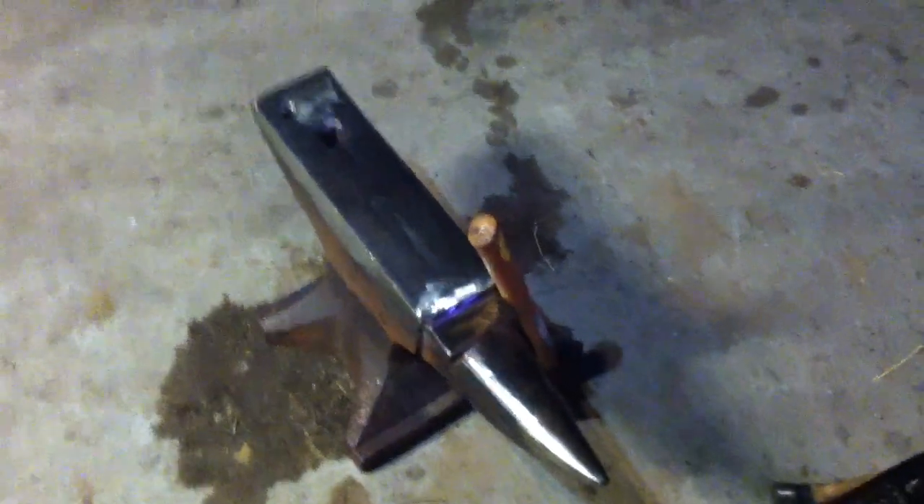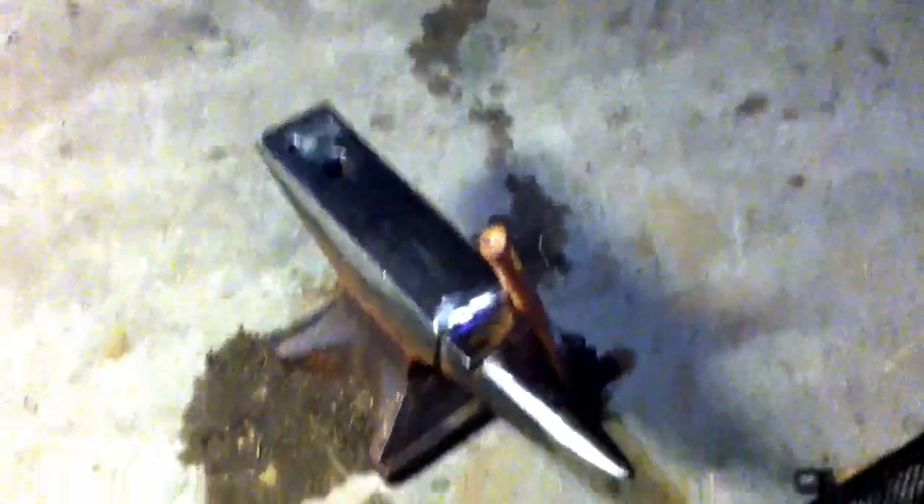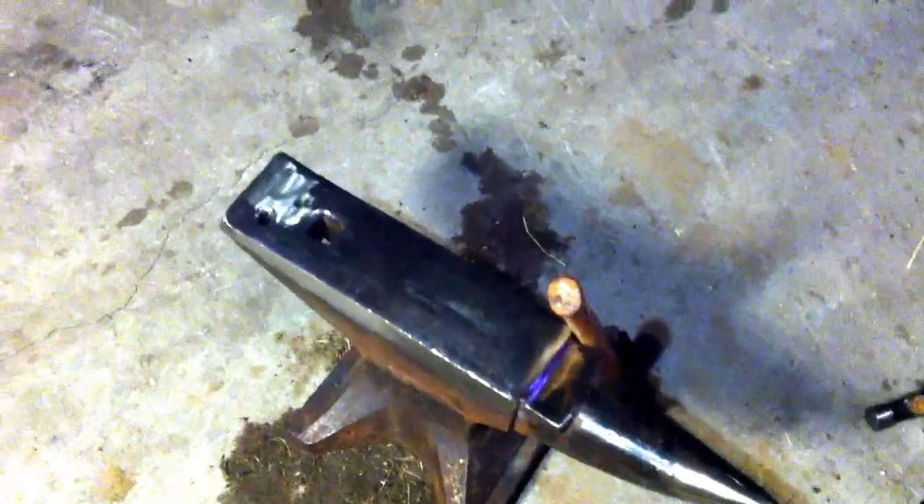This one on the other hand came out a little soft, which was frustrating, but I've come to find that when I'm hitting it with a three pound sledgehammer it's starting to really harden up — almost as much as the Soderfors over there. I still have a little bit to go. In one area where I did work harden it with significant hammer blows, I'm getting a rebound of about 80% to 85%.